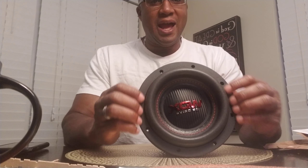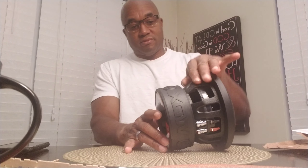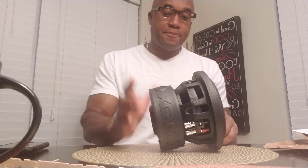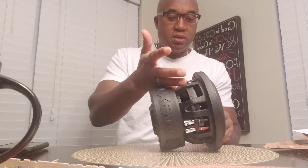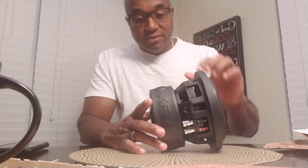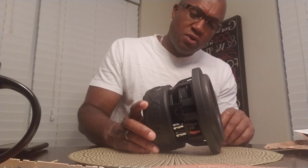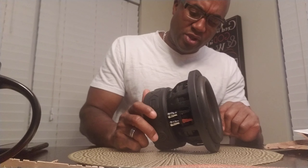Single stitch — the surround is stitched to the cone. It has a non-pressed paper cone. The gasket is standard on entry level — the 12 and 15 are just a smaller version. It has two spiders — yes it does, a spider pack. The spiders are progressive-rolled, poly-damped, glued to the triple joint.